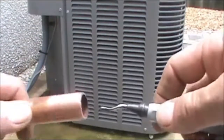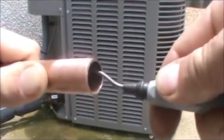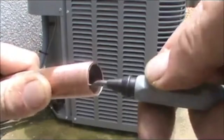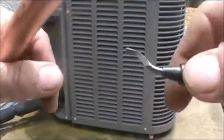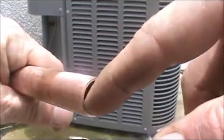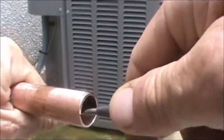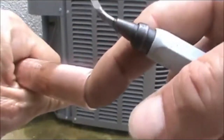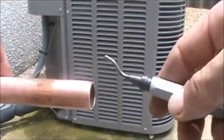So you're going to take your deburring tool and begin to deburr and take away this lip by cutting it out. The deburring tool has a little swivel and a cutting edge, and it will begin to take that tiny little lip off the pipe and take all the little burrs off. Then you're going to do this until you have no more lip on the inside that you can feel with your finger.